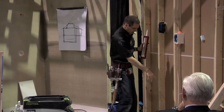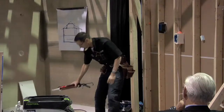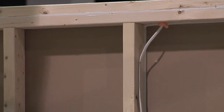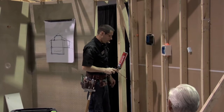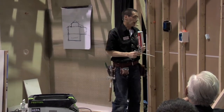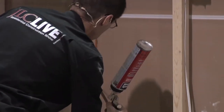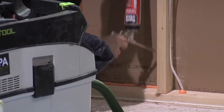There's a hole at the bottom for electrical wire that's already been foamed, but I notice one going up that was not done. Larger holes get sealed with spray foam, which makes a very good air barrier. All larger gaps and penetrations need to be foam sealed. For a really thorough air barrier, I actually foam inside each stud cavity using an adjustable gun to get just a fine bead. I can see a little gap right along the bottom — it doesn't look like much, but I'm going to seal it.